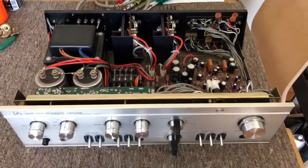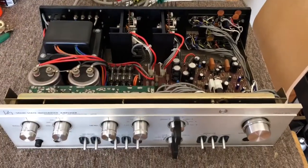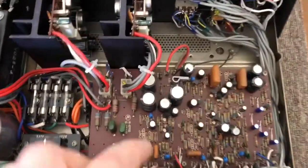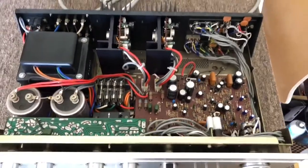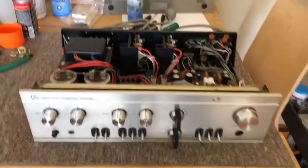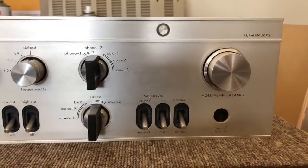This just shows that within the scope of repairs you have different ranges in which you might operate. A customer might say all they want is to have it serviced and returned to working condition — which is what we've done here. That's far less than a full restoration. If I were doing a full restoration I might replace most or all of the electrolytic capacitors, but in this case it didn't fall within that scope. The other thing I did was completely clean the fascia, as you can probably tell comparing it to the start of the video.